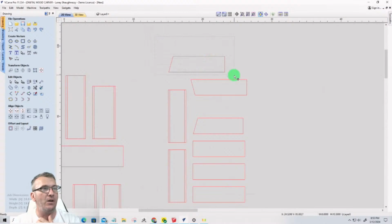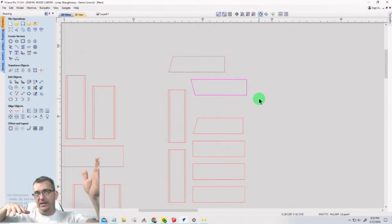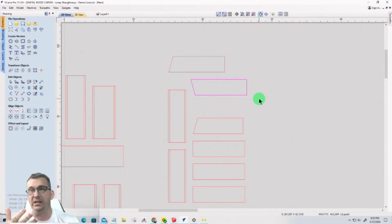So for instance, these are the drawer sides, all these sides with this angle cut on them, right? So we could lay these out on a board on the CNC, and we could just do a profile cut, a 3/4 inch deep profile cut, and we could cut every one of them out on the CNC. Not a problem. But if we have a chop saw, a miter saw, or even a table saw with a sled, we could change the angle to cut those miters. If we have other tools in the shop, hell, we could use a skill saw with a speed square as a guide for our angles. We could draw a line, but we're trying to do a precision cut. So let's leave the skill saw out of it for right now. But a miter saw, a table saw with a sled, or we could use our CNC, right? So use your tools.